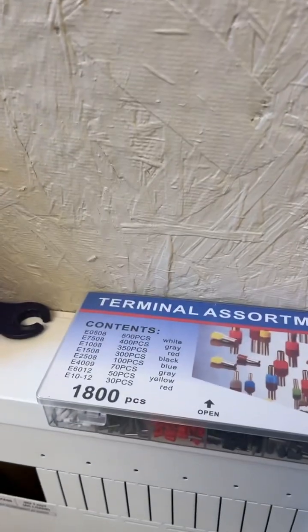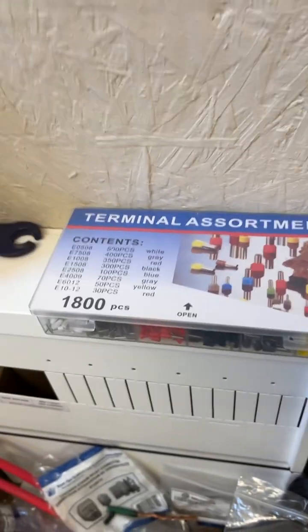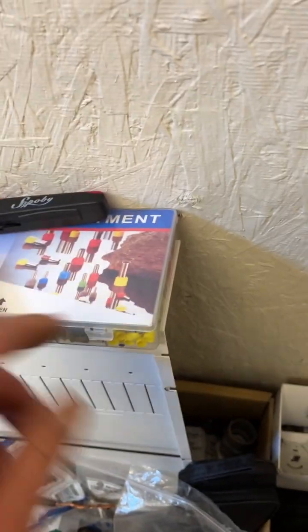So definitely worth it. It's not very expensive. I think the kit was like 30 bucks or something. Works great. Maybe it's not good for long-term use, but this is the only solar I'm building, so I don't need long-term industrial equipment. I bought a basic kit off Amazon for ferrules. I'm going to have 27 of the yellows used. That fits 10 gauge.